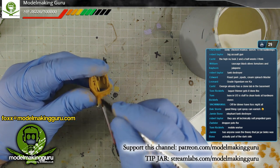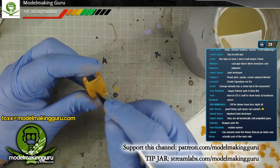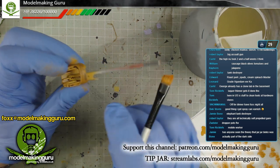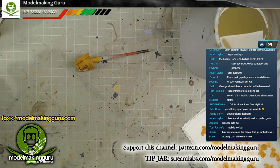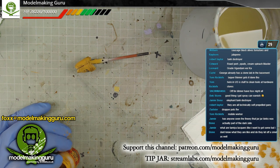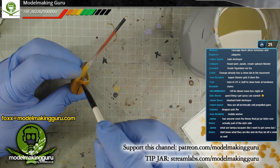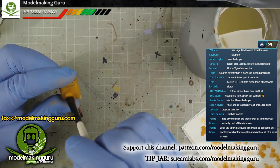But even if you wear a respirator and do your spraying, then go downstairs for half an hour and come back upstairs and your window's not open, the fumes are still going to be there. If you can smell it, it's doing you some harm. That's the trick with lacquers. If you can smell it, you're in trouble. So that's why I don't use them. I can't guarantee good ventilation. I mean, I can guarantee it, but it's still not enough to defeat it completely.